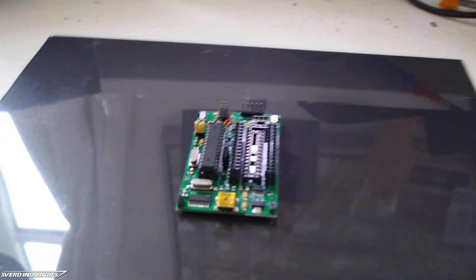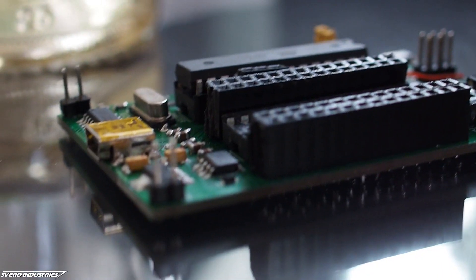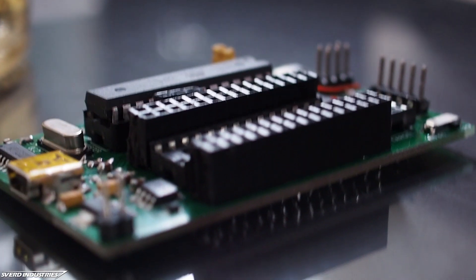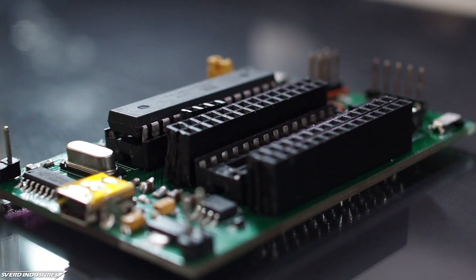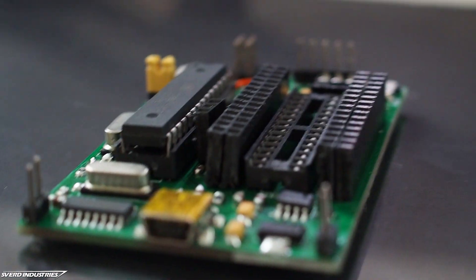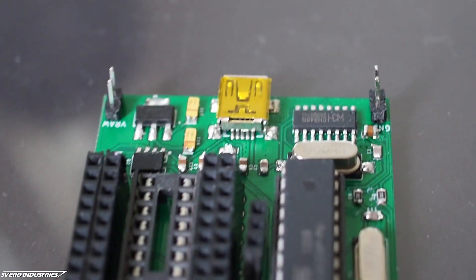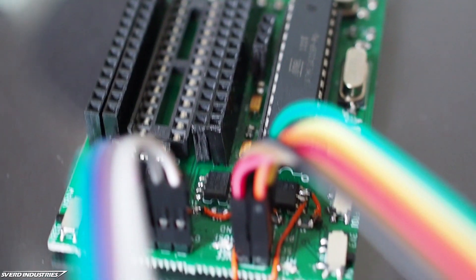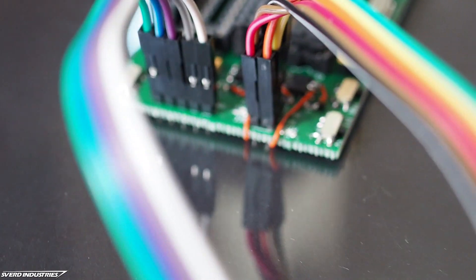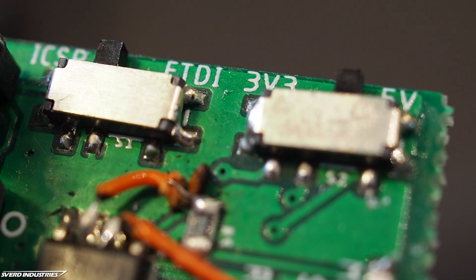What I'm showing you today is how to make an awesome tool for improving the making process for future microcontroller and Arduino projects. This is an AVR ISP bootloader tool combined with a serial programmer. This board has female DIP headers as well as serial breakouts. This means you can program a whole lot of different form factors, and not only that, by flipping a switch you can just as easily burn bootloaders to all of those chips.